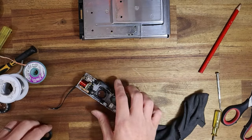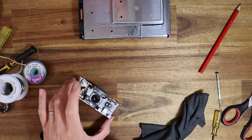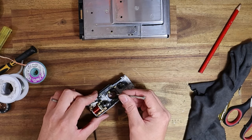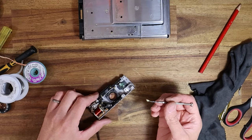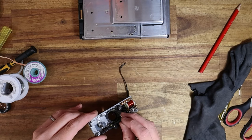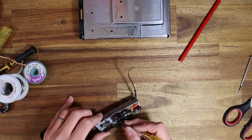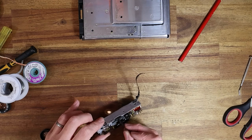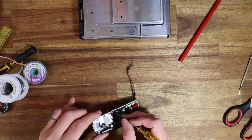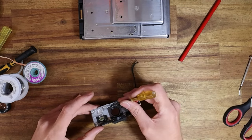What we need to do is add a bit of epoxy before we click the lens cells back together, just making sure I've cleaned this as good as we possibly can. I'm going to grab some glue on one of my little bendy screwdrivers — just a small layer of epoxy on the lens cell on the top where it's going to connect. There's really enough friction fit in these lenses for it to clip in, but you do want a bit of adhesive to help it stay in place as well — that insurance policy is what the epoxy is going to provide.